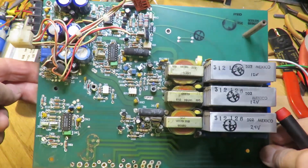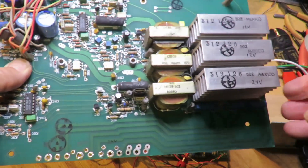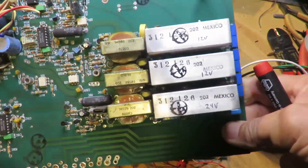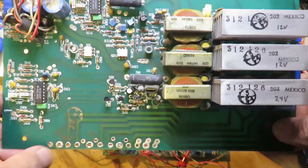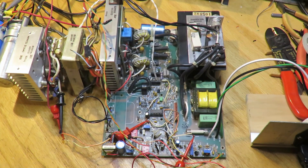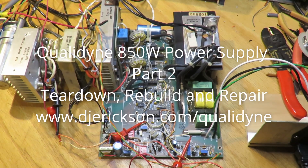I did power up the auxiliary board — I just applied 24 volts DC to one of the transformer winding outputs and was able to get both 12-volt supplies working. I couldn't get the 24-volt supply working. If I need a high-current buck regulator or multiple high-current buck regulators, this board might be a handy way to provide that. I'm pretty satisfied that I got most of the system working, at least as independent pieces. It's been an interesting and fun project — thanks for watching!